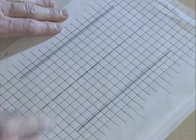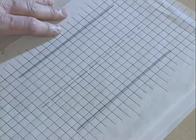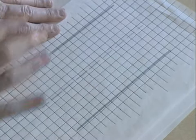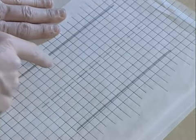Well, let's try centering one row of tiles in the room. So we'll get that in the middle there. See, that looks a lot better. Here you have wide tiles either side. So probably your best approach to a space like this is to look for the design that gives you wide tiles on either edge.